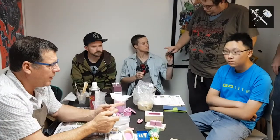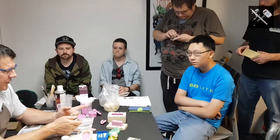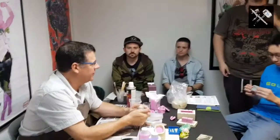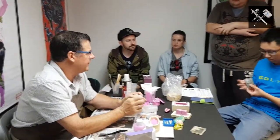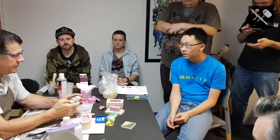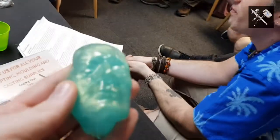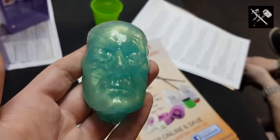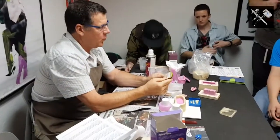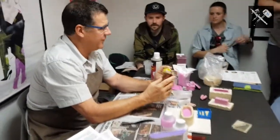The Easy Cast is white, so because you may risk a little patch of white showing through, you could put a little bit of grey pigment in there as well, just in case the stainless steel powder doesn't saturate the resin, so you've got a grey background there anyway. The Pearlexes added to a clear, that's the sort of effect that you'll get. A little bit left of field, probably, from what you people are doing. We're looking at bringing in all the glow-in-the-dark powders as well soon. And this is just more from an artist's point of view, but this is our Easy Cast.